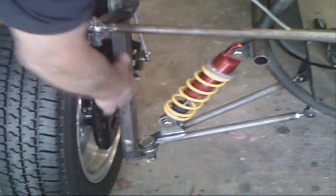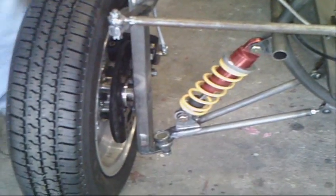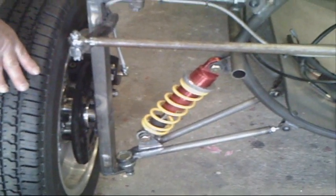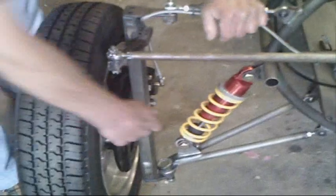To prevent this front end from rolling over on us, because of our frame construction, you'll see a real long fabricated spindle arm here, which actually helps us as far as putting the stress level on our joints and ball joints. Because of the extra arm length, the longer the arm the less stress you have on your rod end joints and ball joints — that gives you more controllability. Fabrication is done by welding here and then inside on the seal part. The rest is just a straight rod that comes out through, which is chrome moly by the way, attached with a simple lock nut.